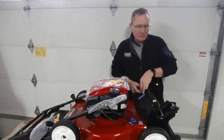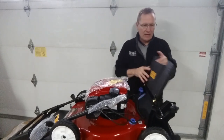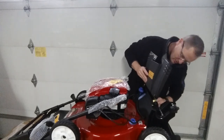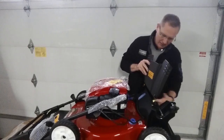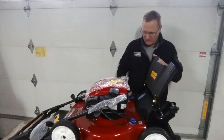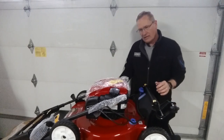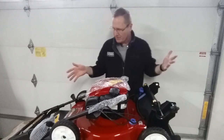There's a little handle in the back that allows us to go from mulching to catching. We lift it up, put the bag in, and that opens the back area so we can catch clippings. Put it down and it mulches. Or if we put the chute in on the side, it will blow back. So we've got all three modes right there.